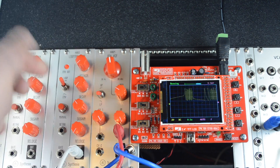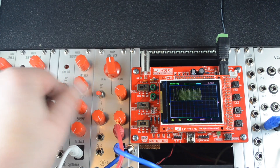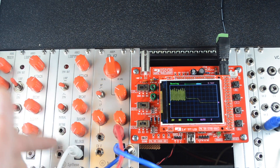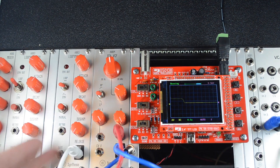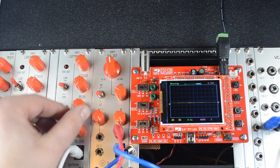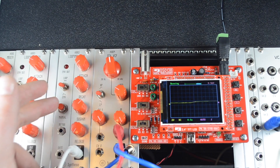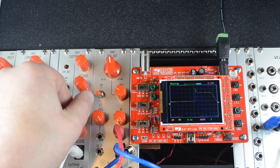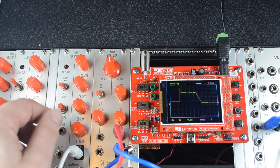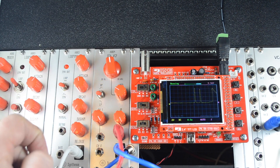There is one quirk, however, which we'll see right now. When you go into envelope mode, if it's been triggered either via the trigger or manual, or if it's coming off of a loop from loop mode, and if the sustain is high, it's going to stay there until sustain goes low. That only happens if there's no gate cable plugged in and the sustain isn't low when it gets triggered somewhere else.